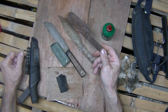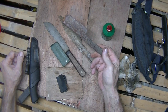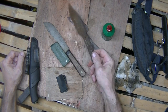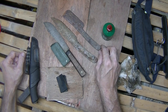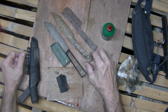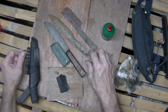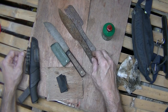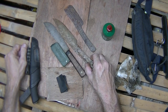And these are the ones here, as soon as you get them polished down to silver, that's when, especially if they don't have a handle on it, you put a really good patina on, either a vinegar patina, a black rust patina, or maybe a banana patina, and then put the handle on so it's got a nice patina underneath the handle. That'll last forever. And the rest of it will be very nice. But again, you still have to oil like crazy, even with the patina on.